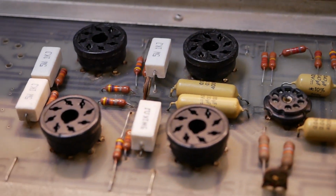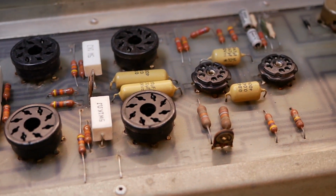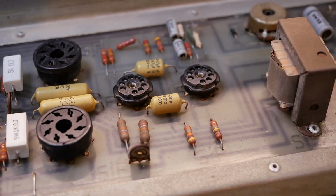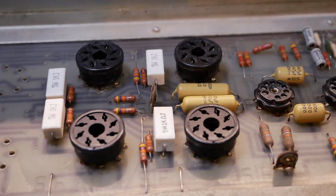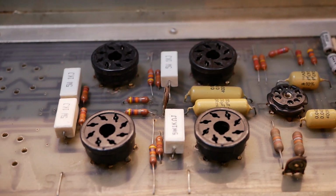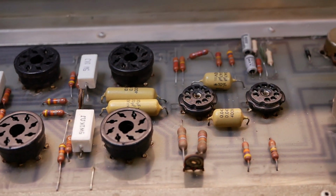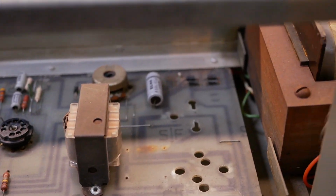And then we'll look at firing this thing up, seeing how she reacts. Test for voltages first, and if we're happy that everything's present where it should be at a percentage of the input mains, we'll throw some valves in there and we'll see how she handles the load and pump some audio through it, see if there's any more gremlins to sort out.